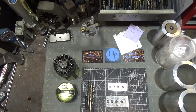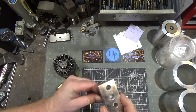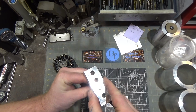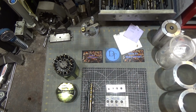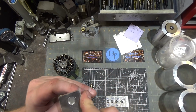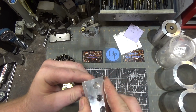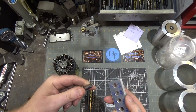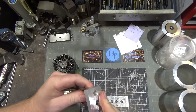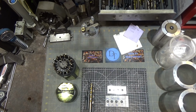Now, all 3 of these are tapered, and interestingly enough, they pass at 0.375 at the end where it tapers down, where they neck down. But if you take, for example, the .378 in this one here, I can only get that far before it stops. And these are deburred. So the cutting action is different the deeper you go, and you actually end up with tapered holes.